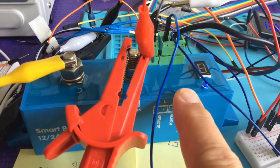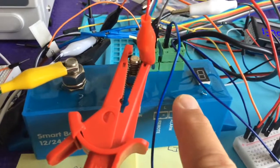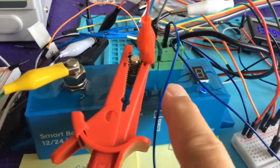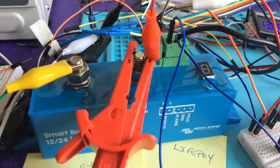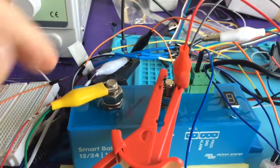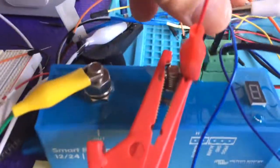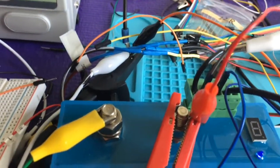And with these batteries, if you get them depleted to less than 10 volts, you lose your total investment. And then you've got thermal problems where you can burn them up at somewhere around 3.6 volts per cell, depending on your situation. So they have smart MOSFET sets in them. They have these sorts of devices integrated in here, waterproofed, and they allow an external relay capability that I can use.